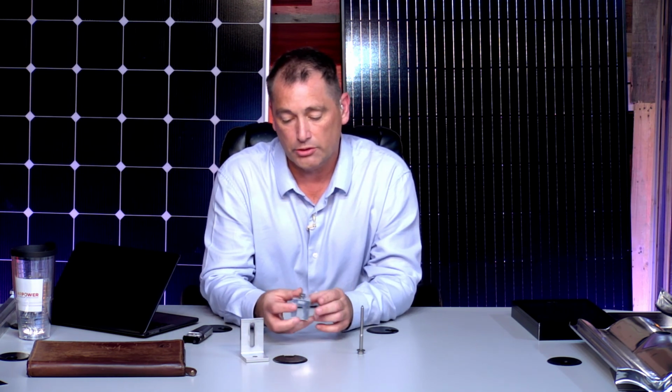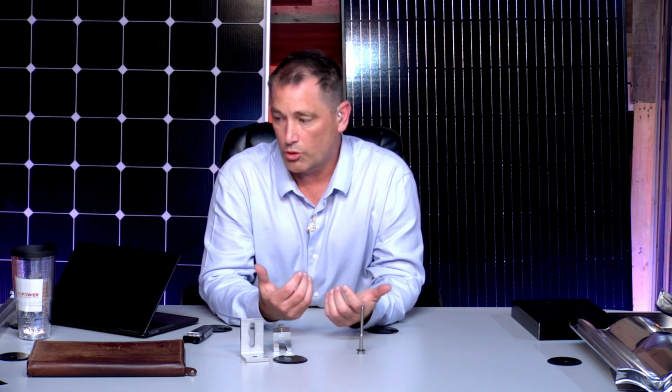So these sit right on the roof. They're fantastic. You don't make any penetrations with them. Now the issue is afterwards, how do we make the wire go through? Because you don't have flashings to use like that flashing box that we used a minute ago. So typically on a metal roof, what we will do is there are times we can go over the ridge. That's probably the best thing to do because it's hard to make a penetration in a metal roof and make it not leak.